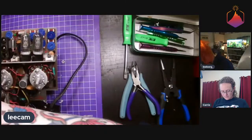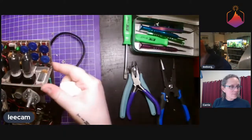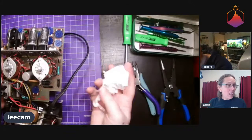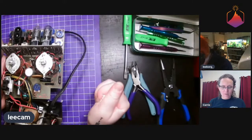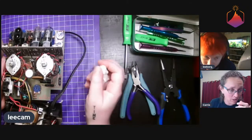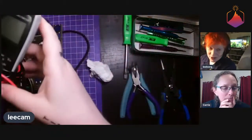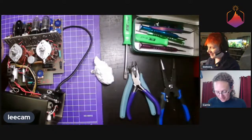Okay, before I get too in there, I don't want to zap myself with any capacitors. Is there anything I can do about that, or should I just go for it? Well, you can discharge a capacitor by shorting it out. Of course, with a voltmeter that works, you could probe across any capacitors and see if there's voltage across them. Okay, I can do that. I do have a modern version. You have a voltmeter to troubleshoot the voltmeter with.